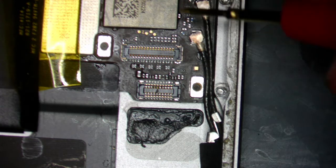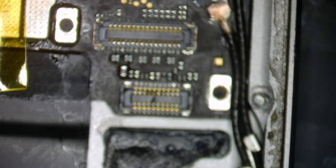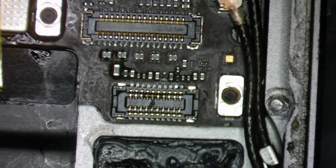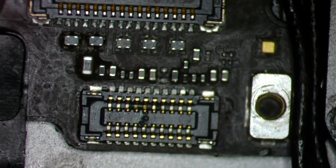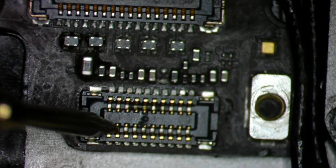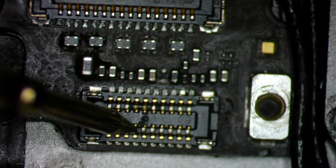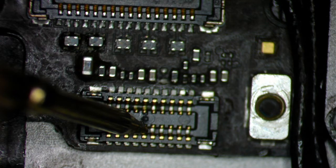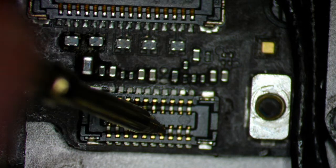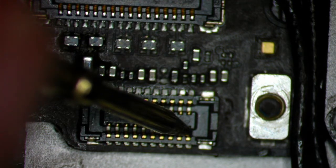Let's let that cool down and we'll take it for a test drive. So we're going to do diode readings of the bottom. The entire bottom row needs to have a reading on each pin. That's an easy one. Right there — 535, 405, 405, 403, 401, 402, 402, 403, 403, 402, 478. Beautiful.